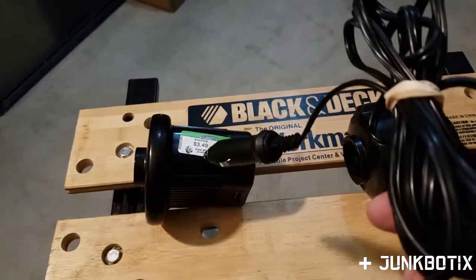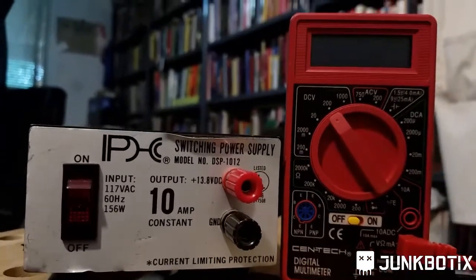You can go camping or whatnot and just plug it right into a power accessory outlet or cigarette lighter in your car. So one inflator is 12 volts and the other is 110. I've got my stuff out in order to test 12 volts — I've got a power supply here along with an adapter. I'm going to hook this up to the 12 volt power supply and test that out. Here's the power supply and you can see I have a multimeter next to it.